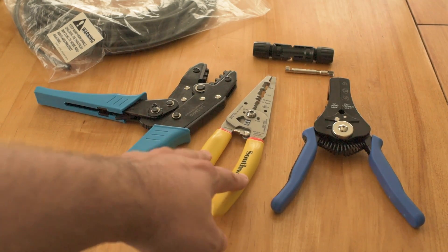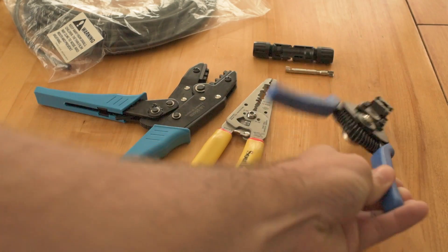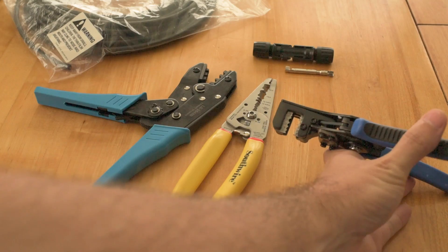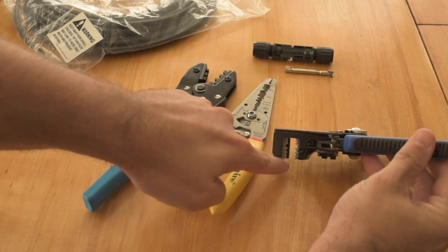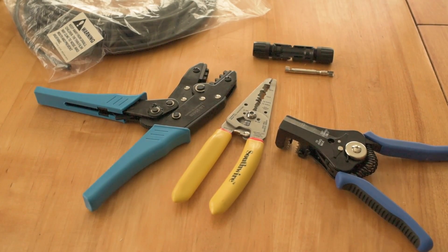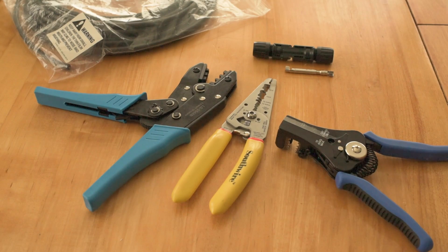This is a wire stripper. This is actually a wire cutter and a stripper — we're only going to use it for the cutting capability. This little guy here is an automatic wire stripper. I use this specifically because it has a large opening and a lot of blade area side to side. Because what you find is that solar PV cable is very thick — it's got a very large diameter. It's much thicker than household AC wiring, and that's because it's DC and DC doesn't have as high of a voltage, so you have to have thicker wire to carry the same amount of current or wattage.